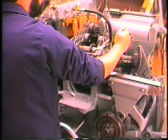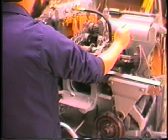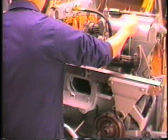The drill must be advanced with the turnbuckle until it is properly positioned. It will be necessary to jog the machine with the hand clutch disengaged once the point of the drill comes in contact with the bar end.